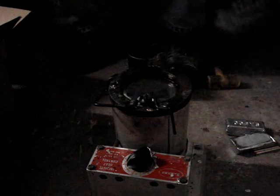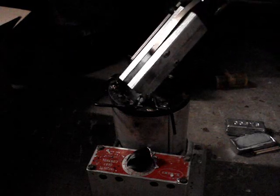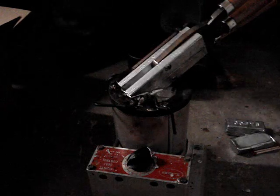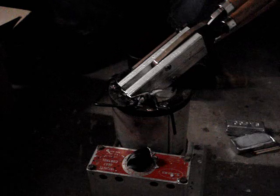That's nice and hot. So here we got the mold. Now the mold needs to be brought to temperature. And the way we're going to do that is, there's several ways of doing it, but this is how I do it. I take the mold in a sprue plate, and I let it sit there. Let it sit there for about a minute. A big guy like this, you want to sit in here for about a minute and a half. On a smaller two-cavity mold, you want it to sit in there for 40 seconds, maybe.